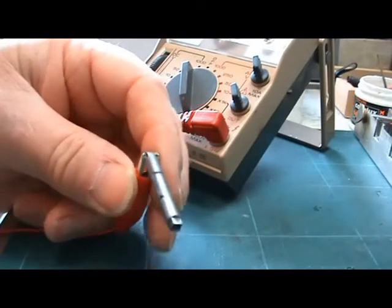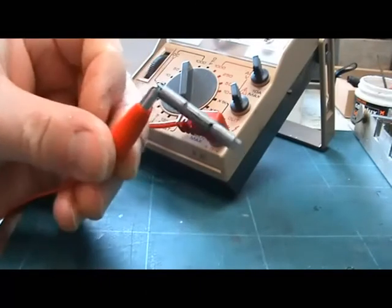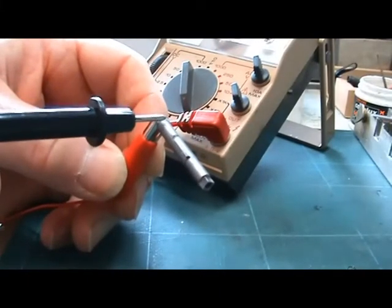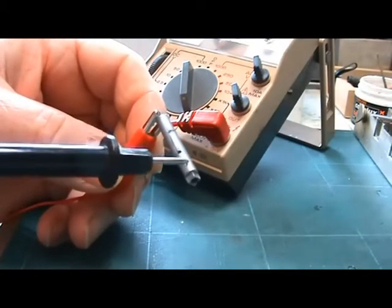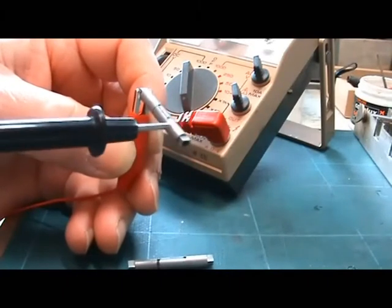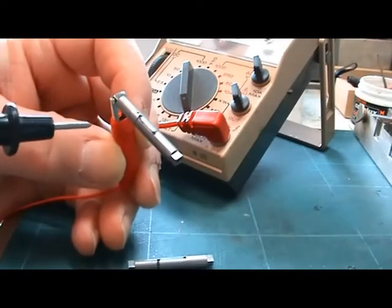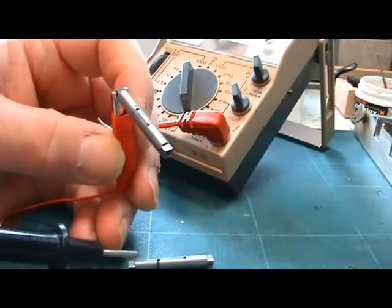Having made the cuts, I'm now going to test the axle to make sure that they are insulated. I've got them hooked up here to my meter on the buzzer. When I touch the two together — buzzer — when I touch the other side of the axle, absolutely nothing. Therefore that one I know is fine. Same with the other axle — check that it's working, and check that side — absolutely fine. I'm now ready to fill these two cuts with some Araldite, just to give it a little bit of extra strength to make sure it doesn't come apart.